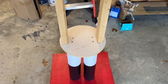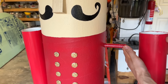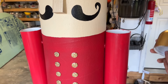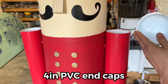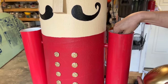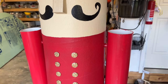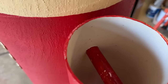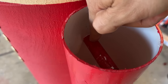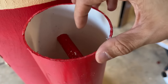Let's put the top part of the body on top. It's important to remember that we cannot have the arm all the way touching the body, because we won't have enough space for the PVC end cap. The end cap goes over the pipe but needs that space to settle down. Don't attach the screw on the inside of the PVC pipe just yet until you're sure it fits. Then put a single screw right in the middle of the pipe on each side to prevent the pipe from moving out. The only way to remove the arms will be to unscrew them.